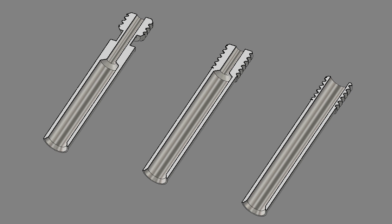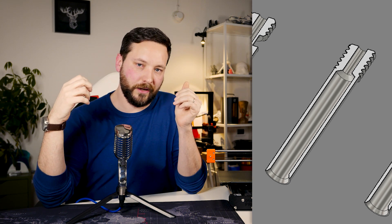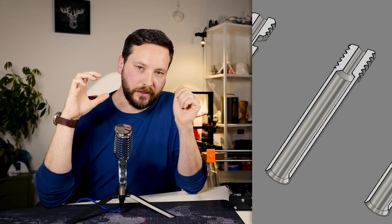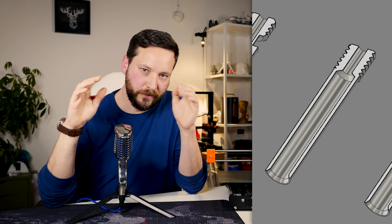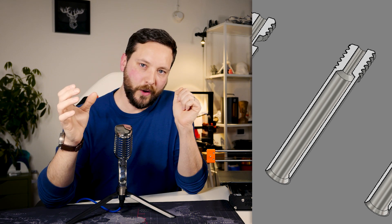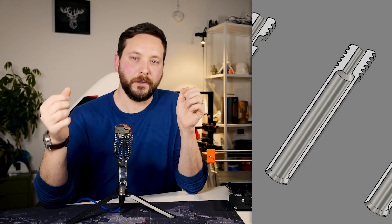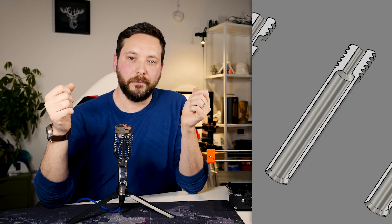Also remember that thermistors and heat cartridges are not exact science, so make sure you're running at a significantly lower temperature — keep a margin to make sure it remains safe. Then in the middle we have the Prusa one. The first thing to notice is that the bore inside is actually tipped — they drill it with a regular drill bit which has a 118-120 degree angle. That requires a special plastic insert, so you can't just take any PTFE tube; you have to take the one Prusa provides, which has the chamfer on the top and sits all the way down into the angled hole. It's a metal heat break from there, with the filament going through metal straight into the nozzle. The rating of this machine is 245 degrees.